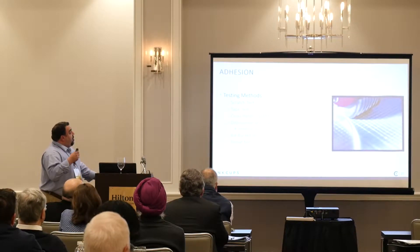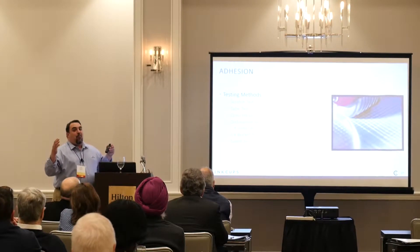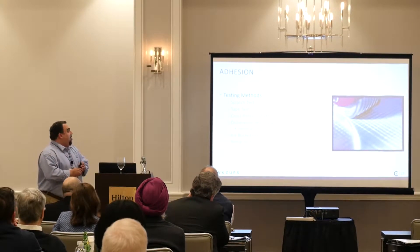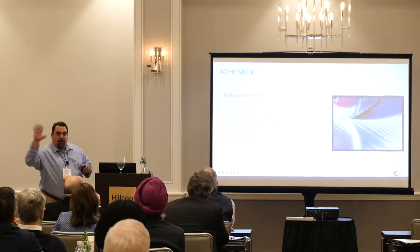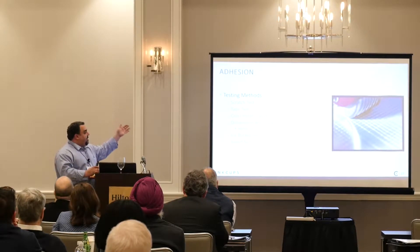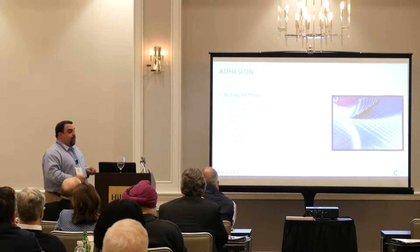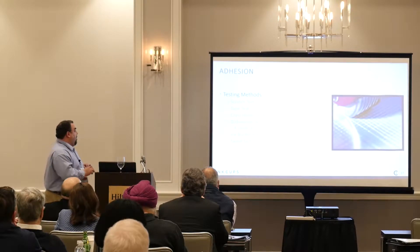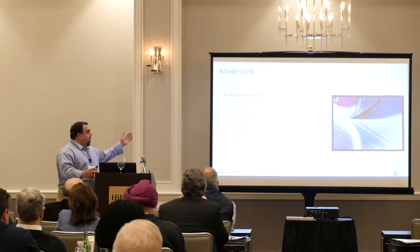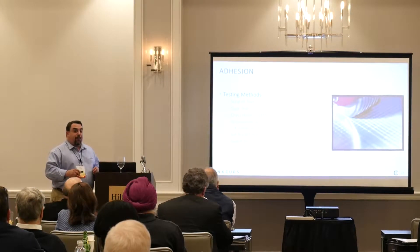When we introduced the Helix, we had to become aware of what adhesion tests consumers needed — they seemed to be all over the board. We found a scratch test and a tape test, but primarily the ASTM crosshatch test method seems to be universal for most customers. It varies by application, and we've also done ice bucket tests and sweat tests with our inks.